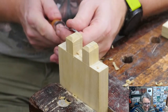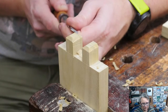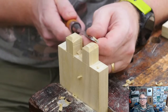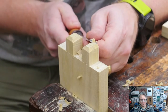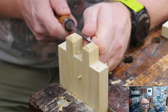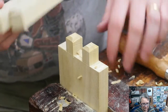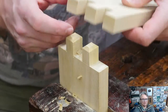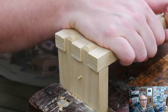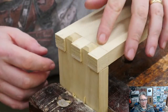There's three sides. And on these outside ones, I could come in with a block plane and just run across them all. I'd have a little bit harder time with the ones on the inside, but if the block plane is right, or if it's a rabbeting block plane, you could very well do that. Here's that one. So we can see, it goes this way. Chisel rolling. See how that pillowing just sticks up a little bit.